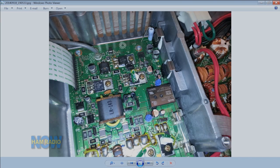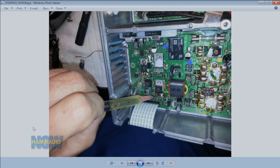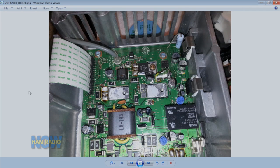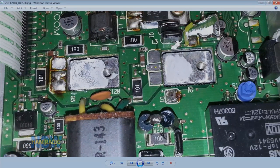All you do is put a little bit of flux on the transistor's terminals, then melt the connection with the soldering iron and apply a little bit of this bismuth — it only takes maybe 50% of the volume of the solder already on the connection. That much bismuth reduces the melting point to about 160-170 degrees. You can quite literally wash the components off the printed circuit board with hot water when you do that. And because the temperature is so low, you can remove the solder iron and you've got a good 20 or 30 seconds to remove the part before the remaining alloys solidify again. So it's real easy to get the part off. Then to clean up the board, I just use solder wick — it's a copper braid with flux on it that just absorbs solder. Then wipe off all that flux with acetone.